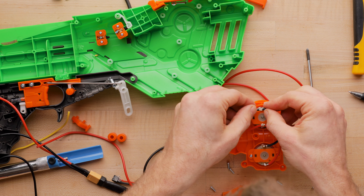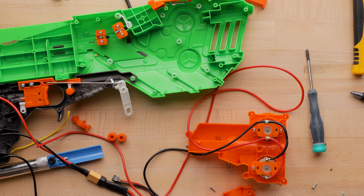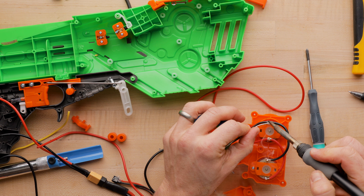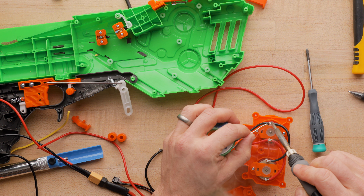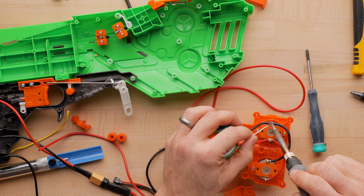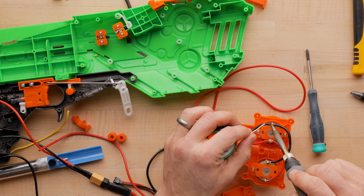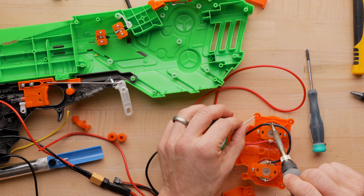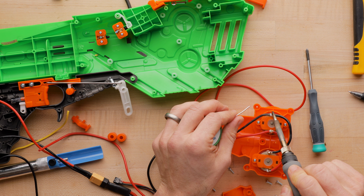I'm creating a slot so I can put the wire over the terminal post. If it has a physical connection like this, it will be a stronger physical connection — if it gets tugged or there's vibration, you'll have a little bit of extra hold. I've built about 80 Hurricanes and only had about one fail due to a solder joint — and that customer is probably watching right now. I hope you got your Hurricane back by now. I always take care of my customers no matter what; that's the core of doing this as part of my income.